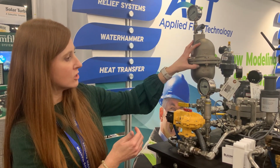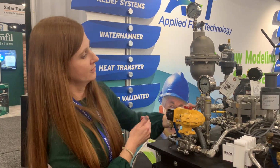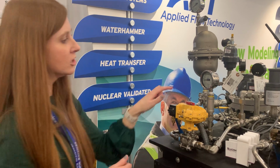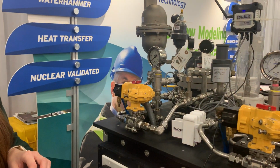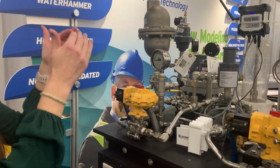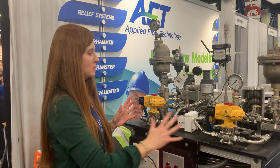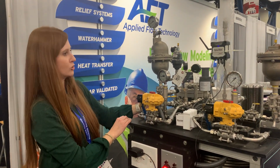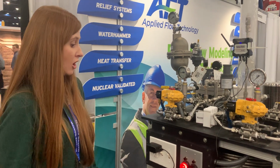When you have a surge vessel designed to give energy, and I turn that on, there we go. You're going to see it drop down, but it's going to be much less dramatic because it's protected. It was much more gradual, and it allowed that low pressure shock wave to be dampened, and then it comes back, and you have much less drama associated with the system.